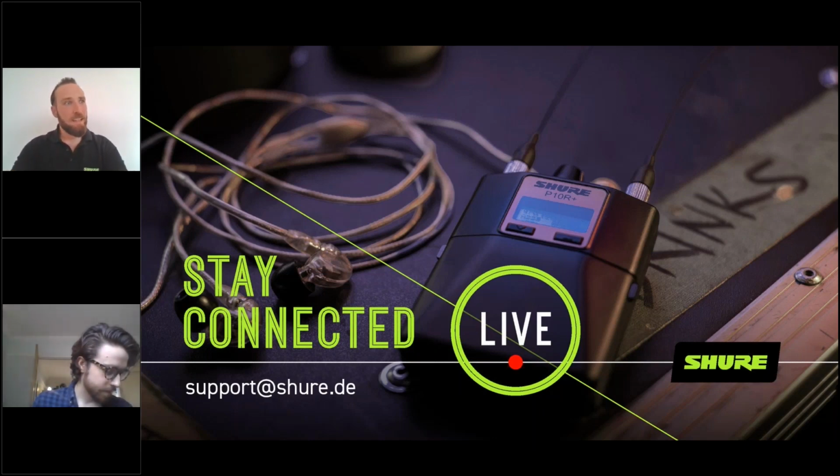Well, it's a really difficult question, because if you use digital stuff, usually you need a microprocessor taking your analog signal and converting it to digital. That usually takes time. The better the processor, the less latency you get, but you will always have a small latency. With Shure's extremely good processors, we could get down to maybe 2 or 3 milliseconds. You will barely notice that, but you have to be careful.